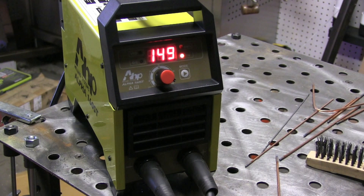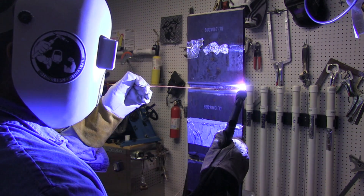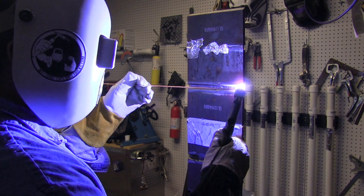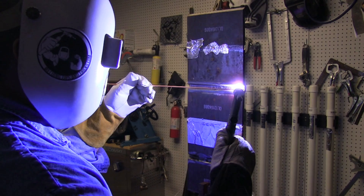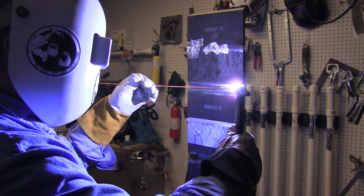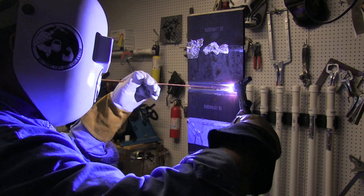I'm going to crank it up now to around 149, 150 amps. Because it's plate, if I'm going to walk the cup, it's hard to start on the end — there's no place for the cup to rest or walk. So I'm going to start off just kind of free handing it, then gradually as I come inboard, I'm going to tilt the torch back a little bit more and lean it back until finally I have a place to rest the cup. I need to lean back far enough and then I can start walking the cup. Normally you wouldn't walk the cup on plate — I'm just messing around here. Walking the cup really comes into play on pipe — that's where it really shines.